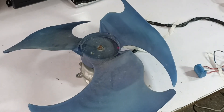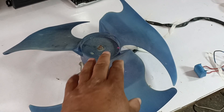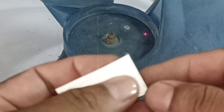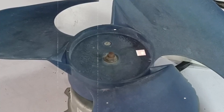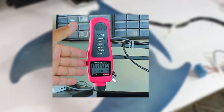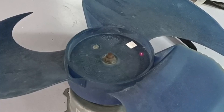To test the RPM, I have installed a tachometer here. You can see a laser — this laser measures the RPM, but it doesn't measure directly. The company provides a reflective sticker for this purpose. I'll take a sticker and place it at a specific point on the motor. This reflective sticker aligns with the laser. Each time the sticker passes by the sensor, it counts one rotation, allowing the tachometer to calculate the RPM based on the number of reflections per unit of time.